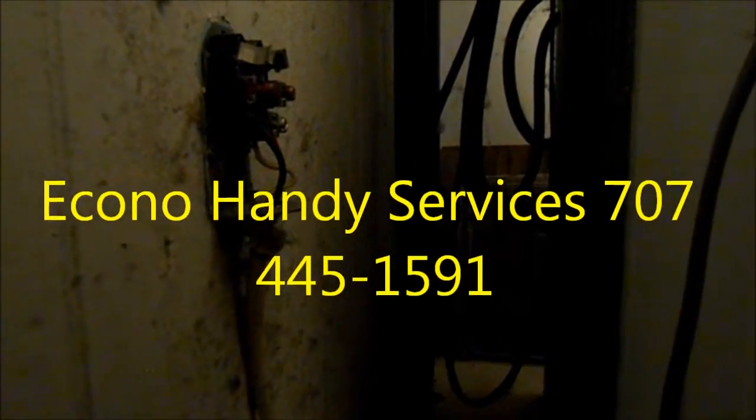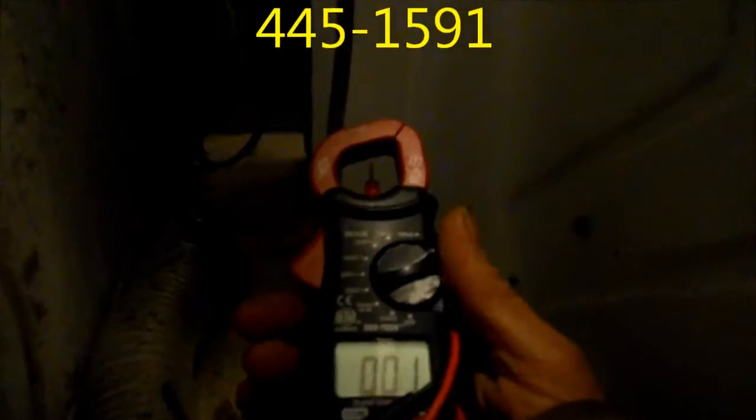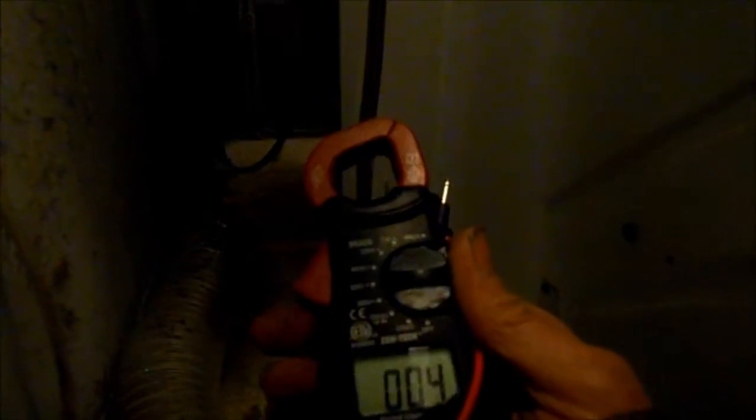The circuit is basically the wires between here and the box. How would you figure that out? It would be kind of tricky — you'd just have to trace the wires down. We're looking for 220 volts here, but we're only getting 110. So there's a problem somewhere in the circuit, somewhere in the wiring between here and there.